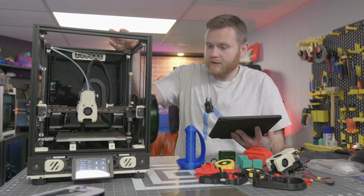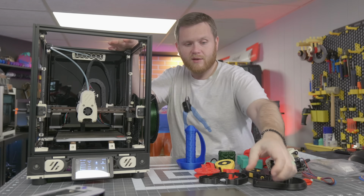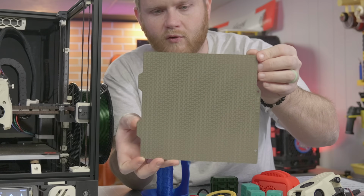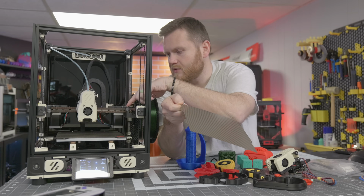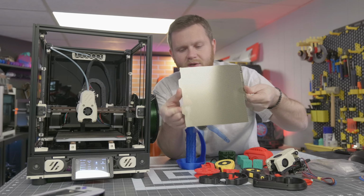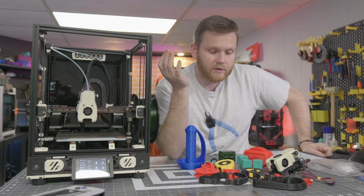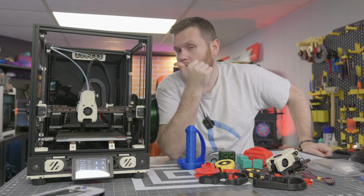And finally, one benefit that I find that's fantastic is that you can use A1 Mini build plates like I mentioned. So this one in particular I've been using on this machine. It has that honeycomb pattern on the front, and then this kind of boxy overlaid pattern on this side. And like I mentioned, you can use these by putting them in sideways, and if you take off the 2 screws for the guides, you can put them on normally as well. It just has slightly different alignment tabs, but it uses the same exact size, and the build plates work for both. So if you have the A1 Mini and you have a bunch of those plates, you can already use them, or you can use the large aftermarket for Bambu machines, so you can get any of those build plates and it'll work on this machine.